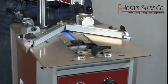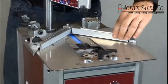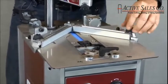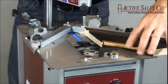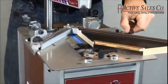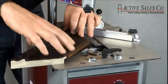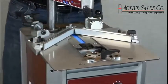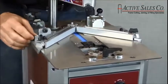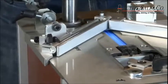The CS20 has adjustable fences that are adjustable in two ways. First, the back fences can adjust to match the profile of the back of the molding you're joining. Just bring your molding against the loosened fence, squeeze it together, and the fence will adjust to match the back of your molding. Do the same thing for both sides and tighten it down — now your molding is as fully supported as it can be. Also, if the angle of your cut isn't perfect, this fence will adjust using the small stop nut, so you can match the angle of your cut and the angle of the back of your molding.